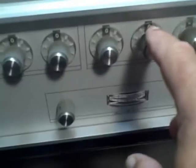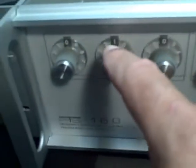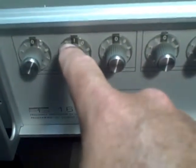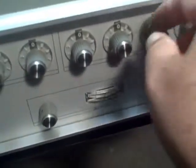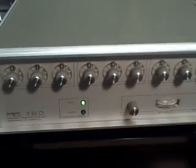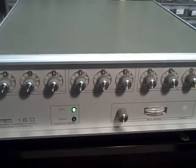So we've got Hertz, tens of Hertz, hundreds, thousands, ten thousands, hundred thousands, millions, ten millions, and hundred millions. Right now we have 1 on the 10 million position, the rest are zero. A moment ago I switched to the 1 on the 1 Hertz point. So this unit has been calibrated to the Rubidium Standard.